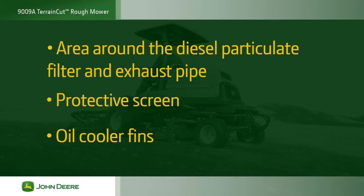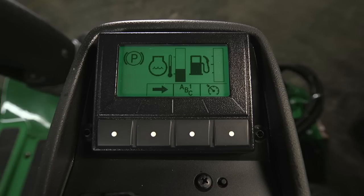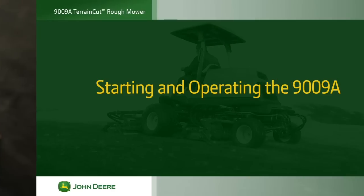Clean out debris in the engine compartment. This includes the area around the diesel particulate filter and exhaust pipe, the protective screen, oil cooler fins, fuel cooler, radiator fins, the battery, and the rear screens. Check the fuel gauge to make sure there's enough diesel fuel to get through the day. If needed, fill up the tank.